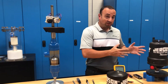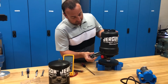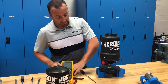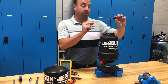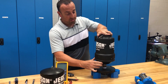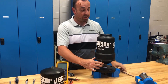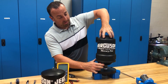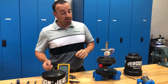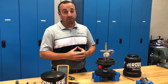If you have an SA-7, we're going to do the exact same steps, except to get inside, you're going to take your Allen wrench, put it into the set screw, and loosen it up. If you need to, put a long bar or a long screwdriver into the notches on top of the castellations and you can turn. There are a lot of threads on here, but it'll come right off. Same rules apply — take your marker, make a line, and move it up or down as needed to get the trip point you're looking for.